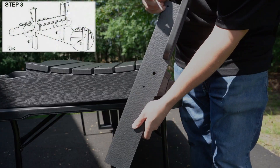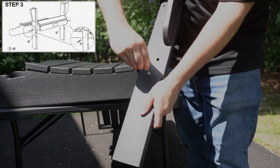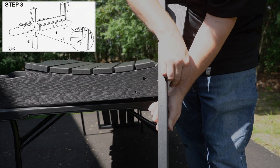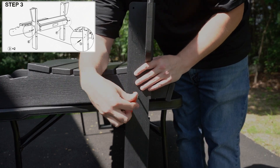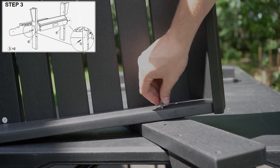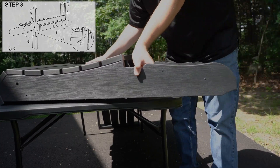Next, we'll go back to Part A, the seat of your chair, and grab the front left and right legs, Parts E and F. With one 60mm bolt with washer and hex nut, thread through the lower, middle pre-made hole on the front leg. Use the hex nut screwdriver to tighten and seal with the hex nut. Since we have two legs, we will repeat this process for the other side.